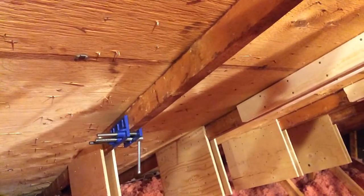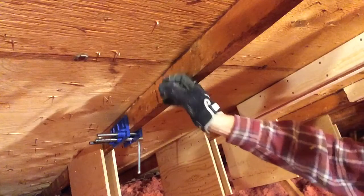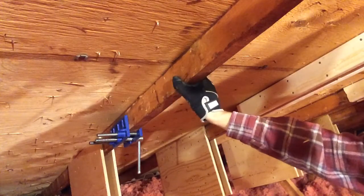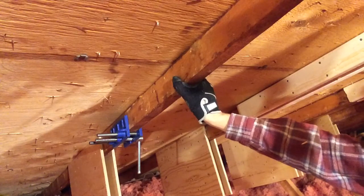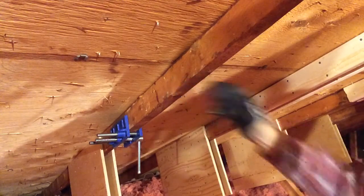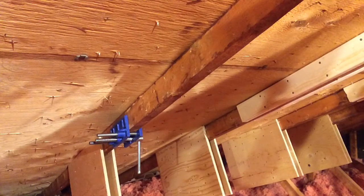What I'm going to do now is make another video. I'm going to put the adhesive on both sides of the old part of this truss, the existing member, so that when I show you the steps, it's the same for jacking the piece of wood into place before and after the glue. So next video we're going to have the glue applied, and I'll show you how to get the wood up nice and tight before you put your screws in.